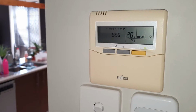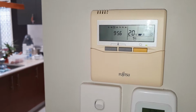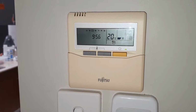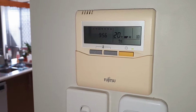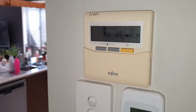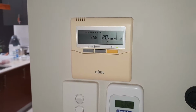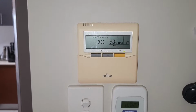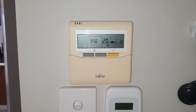And the same with heating, you set 20 but then it starts blowing really hot air and heats it up to 25 and doesn't really hold it where you want, or it's like plus minus 5 degrees Celsius, which is ridiculous. So after some investigation, it turned out that these kinds of aircons usually have two temperature sensors to take the information about the current room temperature from.